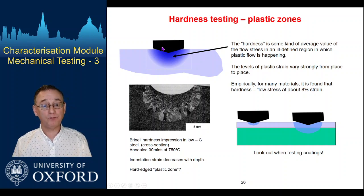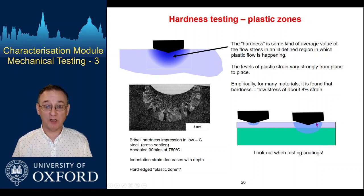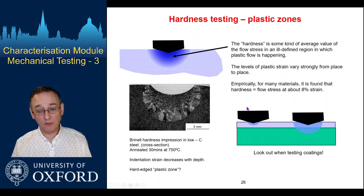Similar things can be done with a pyramidal indenter with similar rules of thumb — more deformation below than to the sides. We need to be aware of this because if we're dealing with a substrate with a layer on top and we want to learn about the layer, if we put the indent in too deep, although the impression appears to be contained within the layer, the plastic zone may have extended into the substrate. The properties measured will then be a combination of both. Instead, using lower loads and a smaller indent crater means the plastic zone can be wholly contained in the layer.